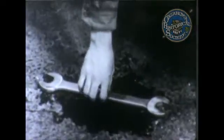Here's another reason why unreasonable strain should never be applied to wrenches. That should prove to you that makeshift attachments cause trouble. Hold it. Let's wipe the oil off that tool before you use it. Oily or greasy tools are dangerous tools. No, Dokes, this wrench is not made to be hit with a hammer.